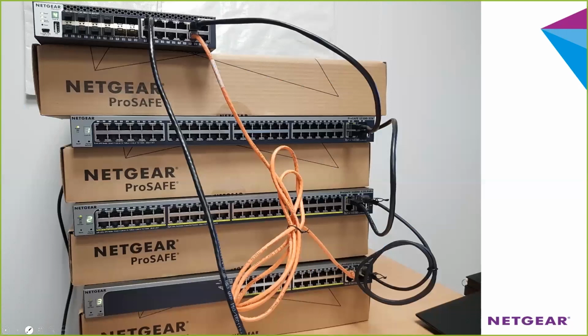Yeah, thank you, Sarah. I can read the questions, actually. Thank you, Jonathan. So that's a good question. The answer is no. So we only have the 12x12F that you see on that chart, and then we have the 24x. So the two 24 port, half-width versions are supported as of now, and we will hear our customers, and obviously we could in the future, although we don't have real immediate plans for it, add more switches. Right now, only 24 port standing models, 12x, 12F, and 24x are supported. We thought that was the right size for a typical S3300 SMB collapsed core installation.